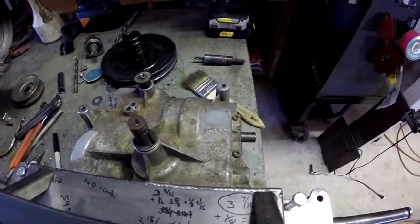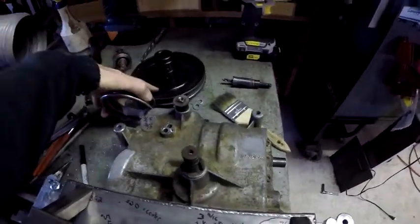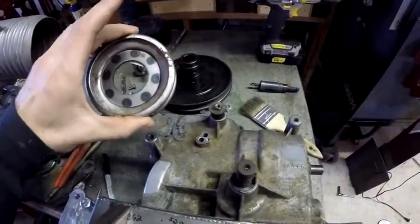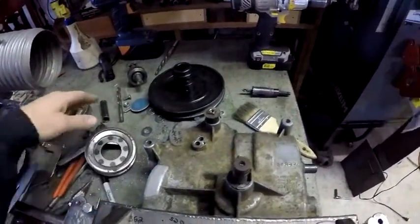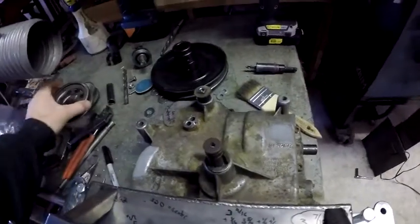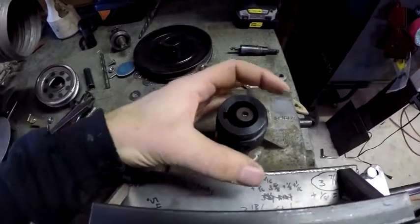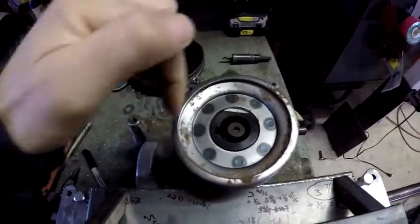This is going to be the style of pulley I want to run. It's identical to this black one, it's just a four inch. I picked the four inch because I needed a half-inch lip here to be able to bolt the pulleys to a hub. If I bought this style of pulley at three and a half inches, it only gave me like an eighth-inch space, and that wasn't enough. So I had to go up to a four inch to gain this lip. This lip is crucial for building a coupler or a hub — basically like one of these — where the right-size piece for the shaft with a big washer welded to it will sit on here, and the pulley will sit on that, then you bolt it through the washer.